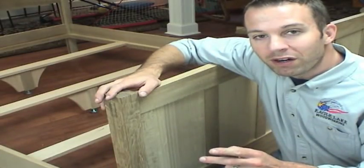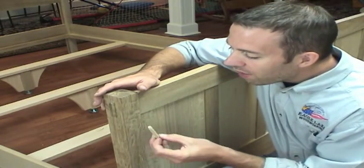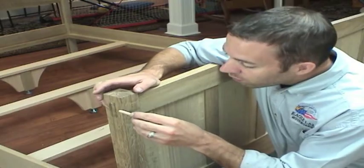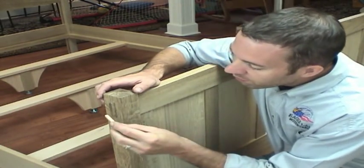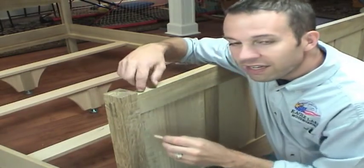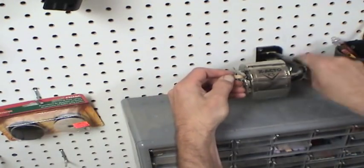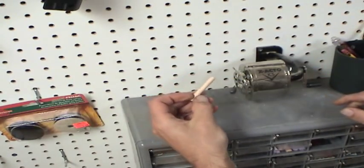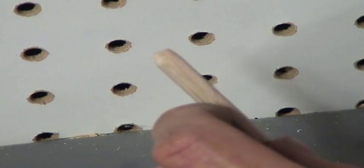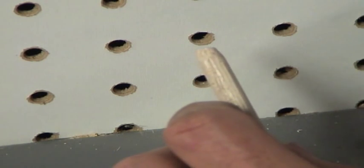This is one of my favorite parts — using a through mortise and tenon joint and pinning the joint. It's called a pinned through mortise and tenon because we take a dowel, drill a hole, insert it through the leg, into the tenon, and into the other side of the leg, essentially locking the tenon in place forever. A fast and easy way to taper the end of the dowel is to use a pencil sharpener. I do this so the dowel goes in easier and the glue has a place to escape at the bottom.